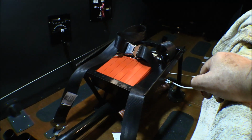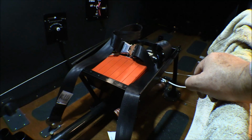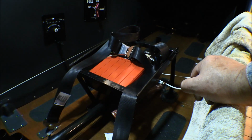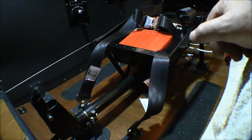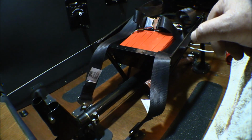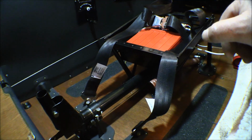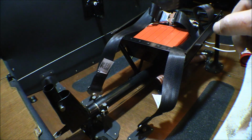So in a sudden stop, you had 150, 200 pounds, whatever, of dead weight in that seat attached with a seat belt, and the forward motion would tear the seat right out, and the occupant would then go through the windshield or into the V-braces or something disastrous like that. Cub Crafters had a modification that they put in this airplane, or in the old airframe when I bought it, to attach shoulder harnesses, and they basically just attached a couple of AN 741-7 clamps to the carry-through member for the rear spar, and then attached a shoulder harness to that.